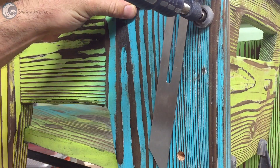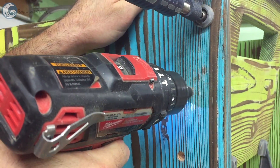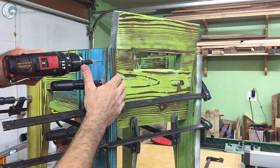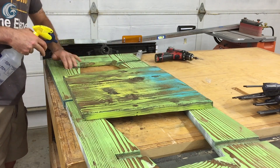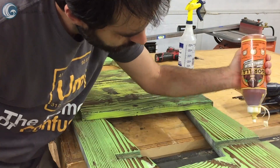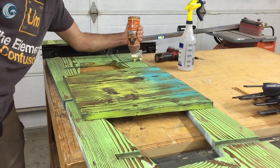To attach the back I assembled the chair with clamps and set a bevel gauge to match the back angle and marked three locations for screws. I pre-drilled with a countersink bit to locate the screw holes for assembly. Then I glued up the chair with polyurethane glue — I chose this glue because the seat was partially painted and the dados were slightly charred, and poly glue sticks to most everything.